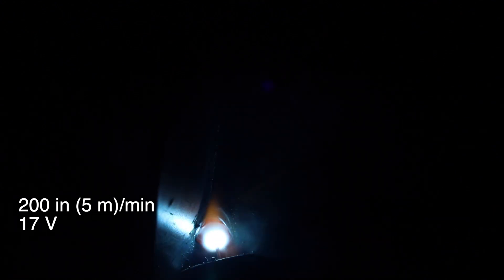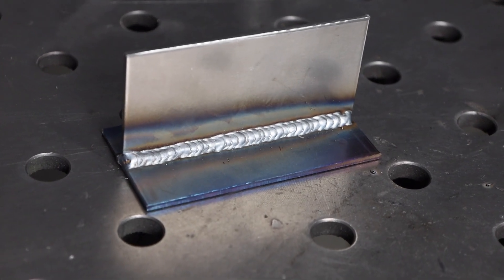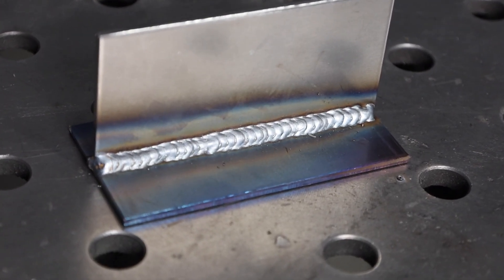For the gun manipulation technique I'm tracing up along the front leading edge of that puddle, moving around in little loops or triangles. I'm spending a little bit more time at each corner, then touching the front leading edge and then the other corner on the other side. I'm not going all the way to the edge of the puddle because the puddle will go further than the arc, but I'm getting enough time for it to tie in, and that helps everything lay in nice and flat. After this is run we can see it laid in much better than just welding that stringer bead vertically up.